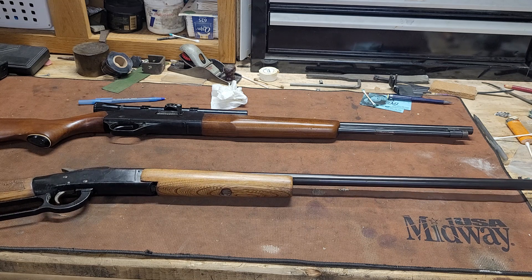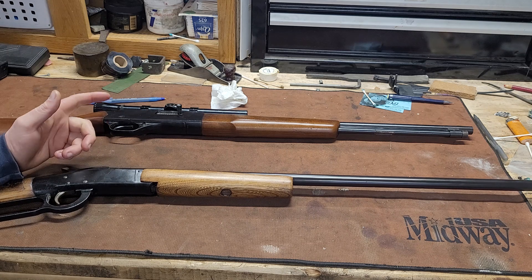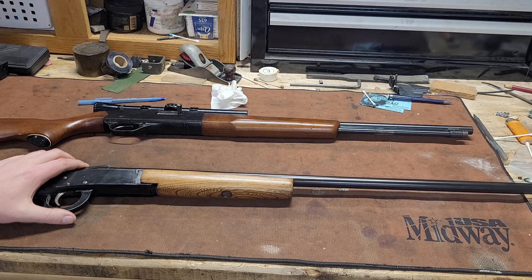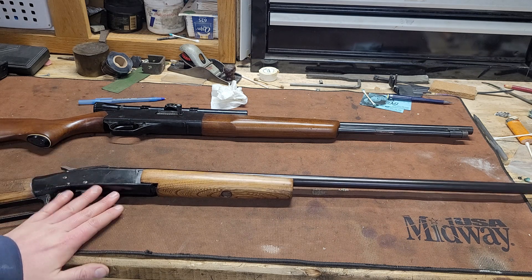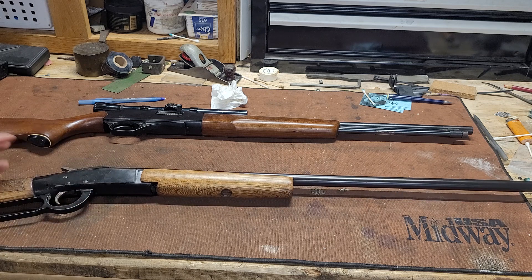It's not as bad as the hot tank bluing chemicals, which are pretty terrifying. I believe if you want to blue stainless steel, calcium hydroxide is the basis of a lot of those solutions — and that's not stuff I want to work with. The regular hot tank stuff scares me enough because you've basically got a five-gallon bucket full of 400-degree super-saturated salt solution. It's not stuff you want to be dealing with much if you can avoid it. On that note, thanks for watching — I hope you enjoyed it, and I'll probably leave a comment with the customer's reaction. I do think they turned out pretty well.